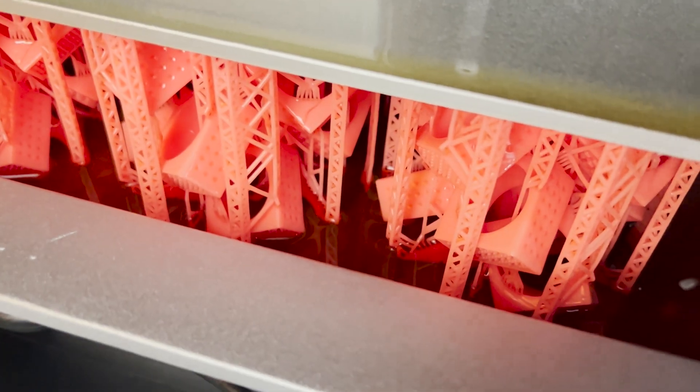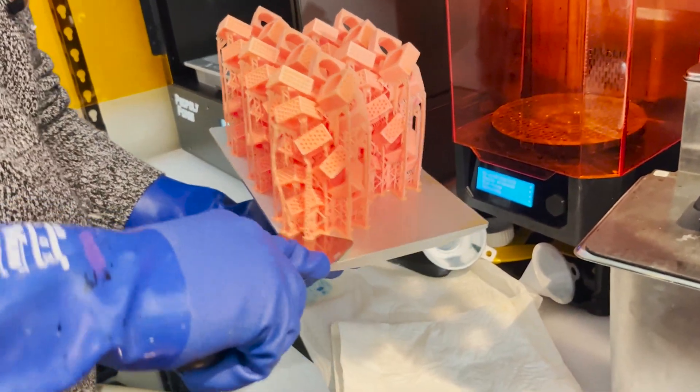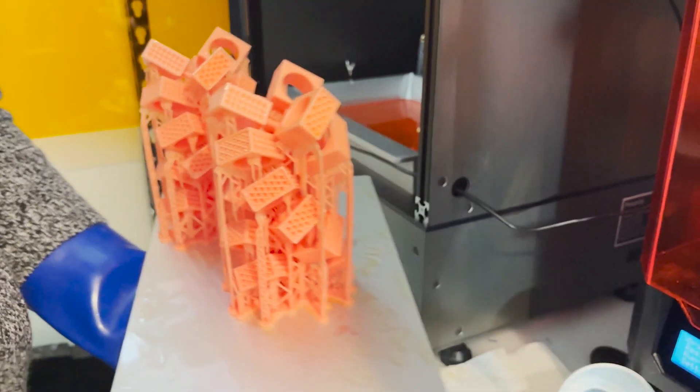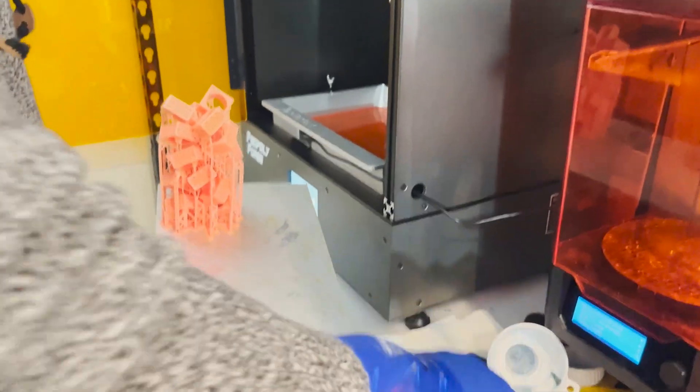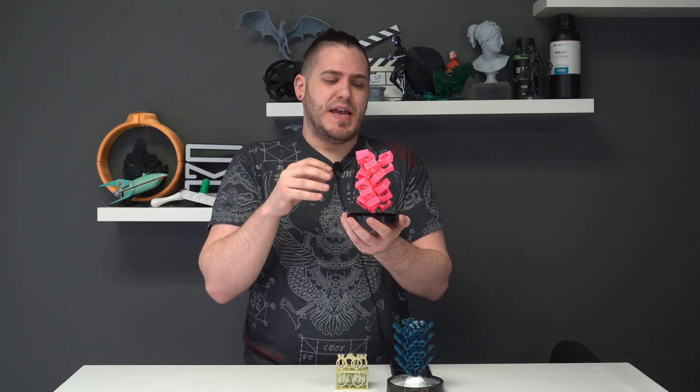And of course, the last thing is patience. Doing one to two trees isn't too bad, but when you get into production levels and high capacity, this can take up some of your time. Just remember that as bad as it might be to take supports off, it would probably be worse to build the tree by hand. Building one of these trees takes me an hour and a half to two hours; by printing eight of them all at once, it's saving me like a full day and a half's worth of work. These are already designed perfectly to fit, and if done by hand you'd fit fewer pieces and it wouldn't be as uniform as a print. Using this method, assuming you're a service-based business, going this way guarantees that you have a certain number on the tree being cast so that you can provide very accurate quotes and make sure everything gets done on time, which your clients will very much appreciate.